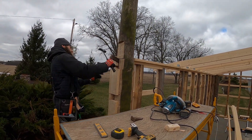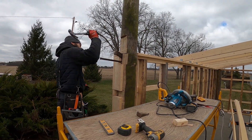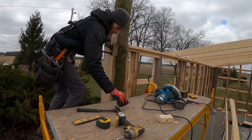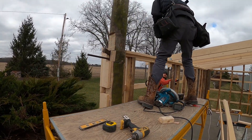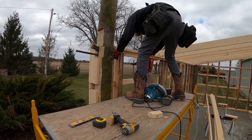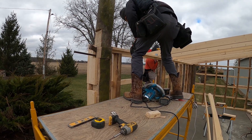What Chad's doing here is we cut a block out of the telephone pole. We're going to put a four by six up there that's going to extend out to carry the rafters. That telephone pole has come in pretty handy as far as stability for the corner of the building.